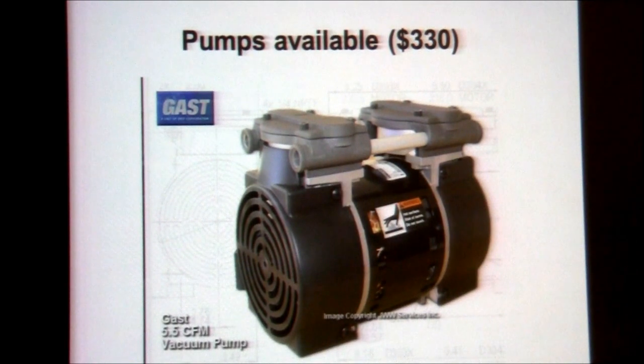Well, this is a technical question: what is the difference between the brass fitting and the steel fitting? Especially when you consider the cost, it's a significant cost difference. Yeah. But why brass? Brass doesn't spark. Oh, okay, that's good enough. Yeah, a number of different things. It's more resistant to corrosion. Well, that makes sense. Corrosion, spark, things like that. Brass doesn't rust, of course. Functionally, they're both equivalent, but there's less bad stuff that can happen to brass than to steel. The elements are less likely to interfere with it.